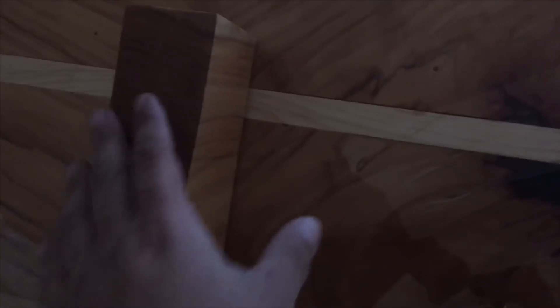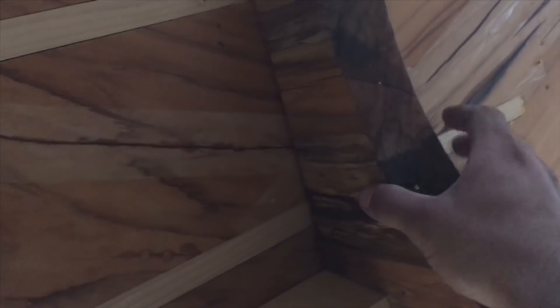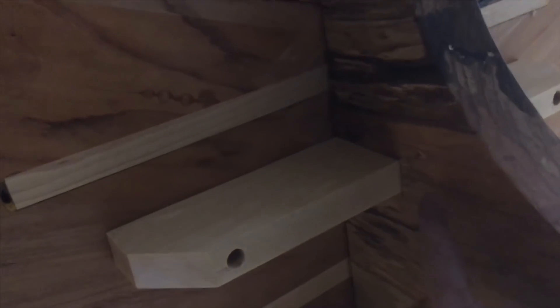Here's the underside of this huge table. This is the leg and these are splines — one, two, three splines here and one, two, three splines here. There are also floating mortises all through here — I think there's seven on each joint. These cleats are screwed up to here. They screwed the leg first and these are hand cut mortises in this three inch thick pecan. I hand cut these mortises, then screwed this cleat to the top of the leg. We slide the leg underneath here and then screwed the cleat to the bottom of the top. There's the waterfall edge.